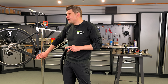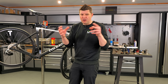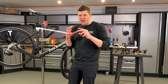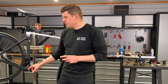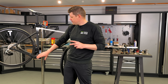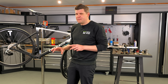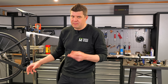There are probably three ways this can be built. One: get two aluminium threads, bond them in, put them on a jig, and hope for the best while the glue cures. Two: use some sort of carrier — maybe plastic or wax — to guarantee alignment. Or three: use an entire aluminium tube you can either leave in to guarantee alignment or machine out afterwards — though that would be expensive. I have no idea how Colnago made this, or how other brands doing single-sided bonding threads do it either.